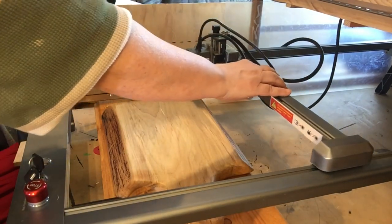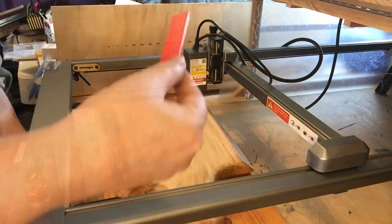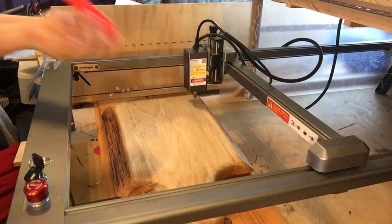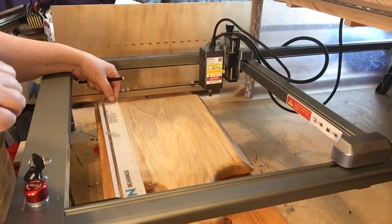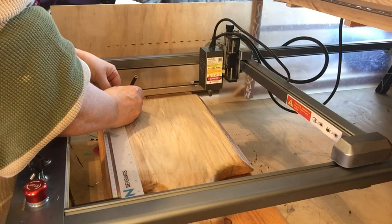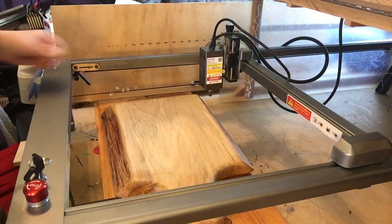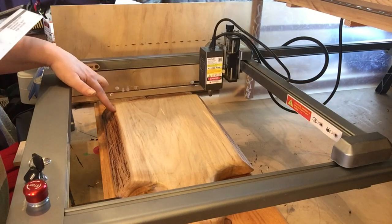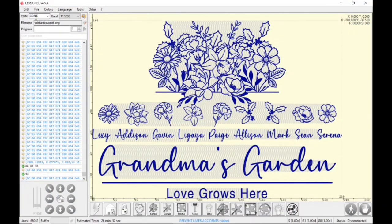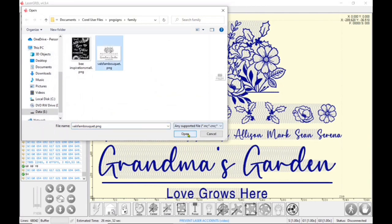My machine is turned off and right now I'm going to focus my laser. With my OLM3, it's got the little kick-stand and I will focus it in a number of spots — not just one — because I want to make sure my board is completely level. My charcuterie board wasn't exactly square, so I decided which edge was the straightest to use as my bottom. Then I used a T-square from the left-hand side and made my line across, measuring how far I wanted to come in.